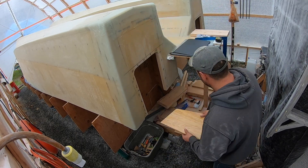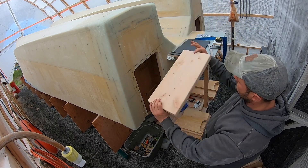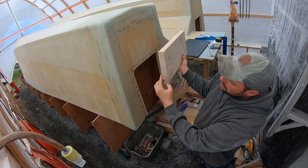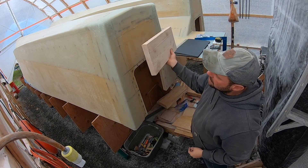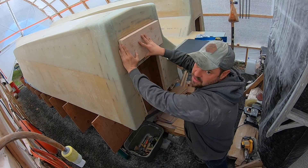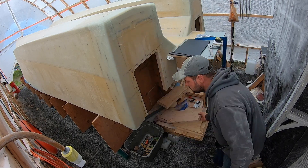I'm going to mount a piece of two-by-eight — maybe two-by-eight — so we'll clamp this in. I gotta bevel the back side of this so the glue doesn't stick to it, that way it gives the glue somewhere to go when we clamp everything in. I'll clamp this here after we cut the opening out, and that'll give me something to butt the sides against to make sure it stays straight, square, and level.